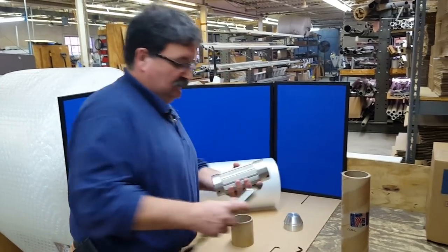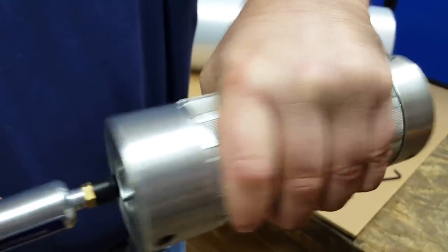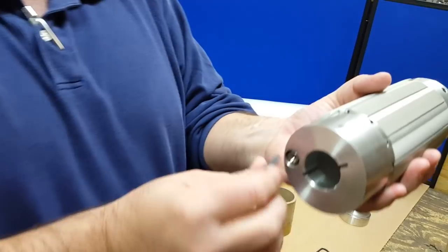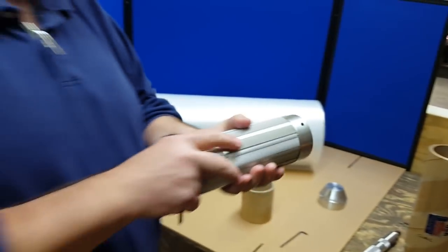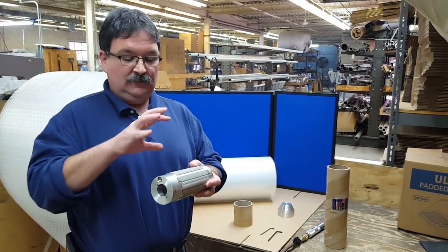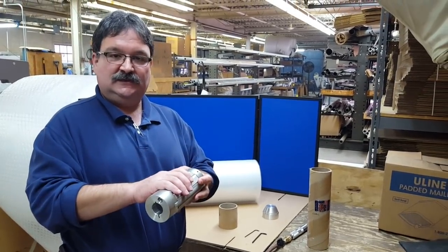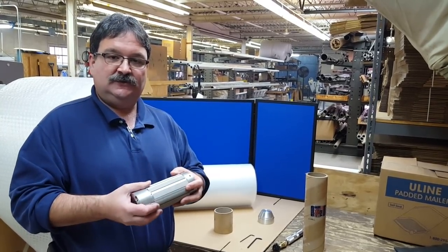To see the amount of inflation without the core on there, as I inflate it you'll see the leaves come out. Now that's inflated. When you deflate it, you'll see the segments move in. That's how much inflation and deflation we get. Dimensionally, we manufacture these air chucks to be about a sixteenth underneath the nominal core size — so for 3-inch, this is two and fifteen-sixteenths, and when you inflate it, it'll inflate about a quarter of an inch up to three and three-sixteenths.